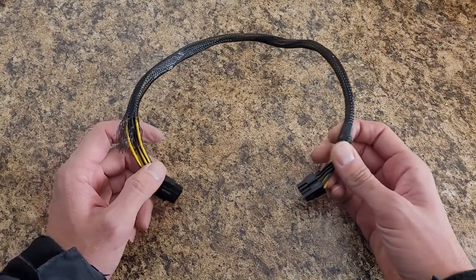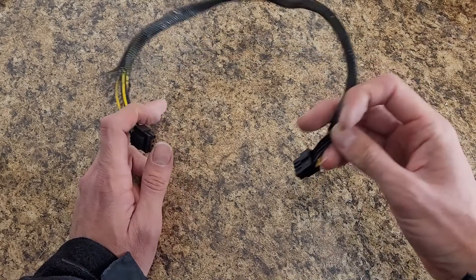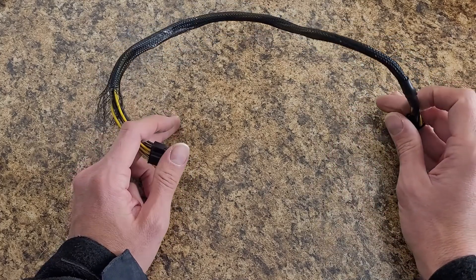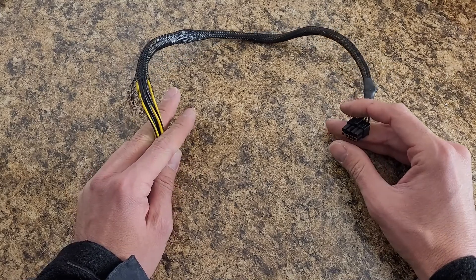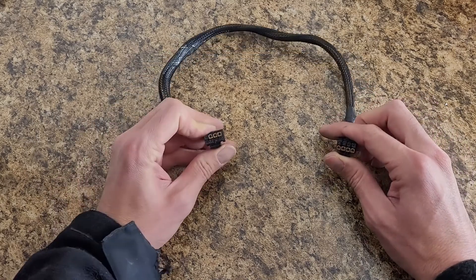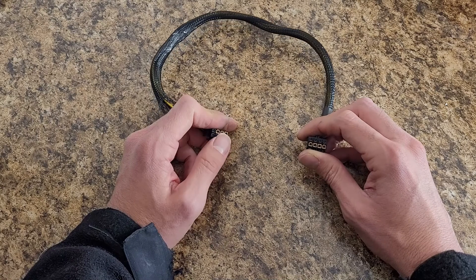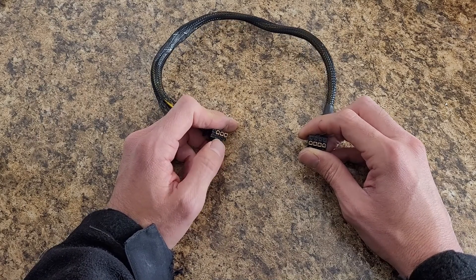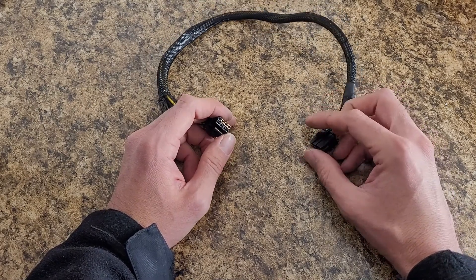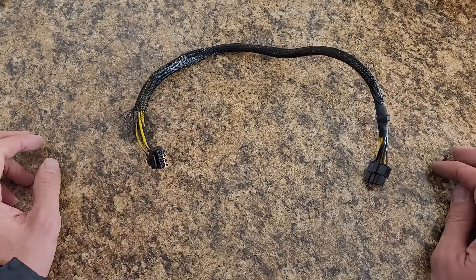This is a nice tidy solution, especially in future ones where I'll probably make a couple more — I'm literally just cutting these ends off dead power supplies. Now that I know what I'm up against I might make a couple nicer ones and maybe try selling them. Though there's kind of a liability issue because there's no difference in the keying on either end — it's keyed exactly how it's keyed on the riser and exactly how EPS 12-volt is keyed — so the only way to stop somebody from plugging it in the wrong way would be putting a big warning flag on it saying which side is the Tesla and which side is the riser. Hopefully that's interesting — thanks for watching.